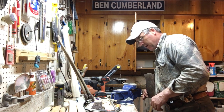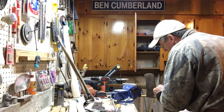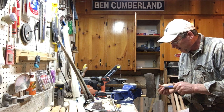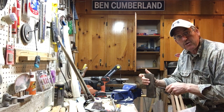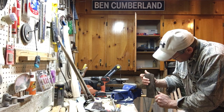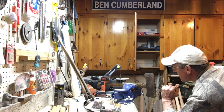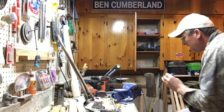Once I have it in the vise I find my trusty flat — that's just a regular flat screwdriver. The screw in here is a flat-headed slot screw, so I should be able to back it out. And it is backing out — you can see here very nicely. So that's the first chunk of metal out of here — that's the screw. Once you get that out you can actually go in the groove there, the kerf, and you can pry out the rest of that wood there in the middle. That one's coming out. If you can keep putting the screwdriver in there and prying that stuff out — you can feel there's something else going on in there, so there's likely going to be more metal.